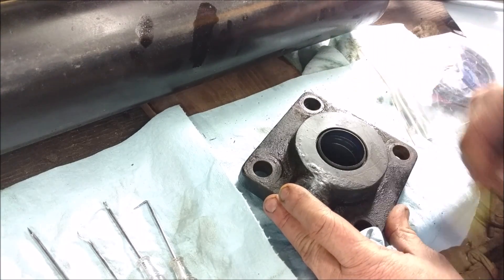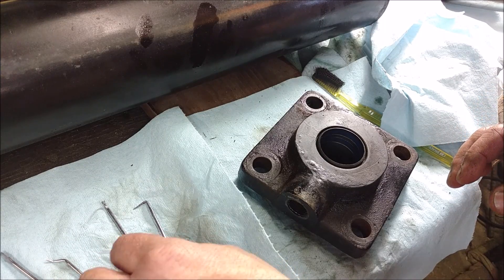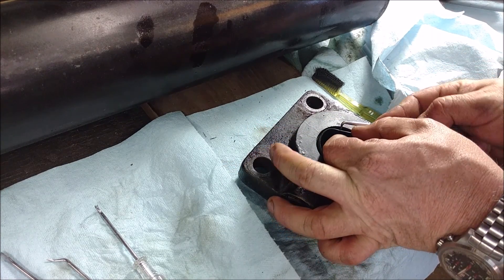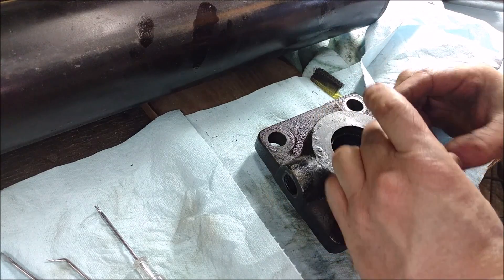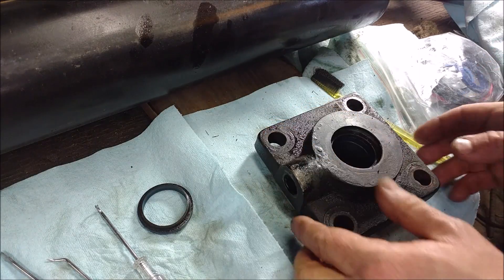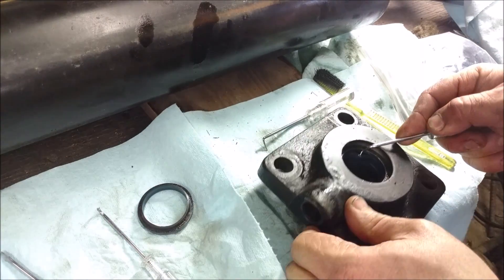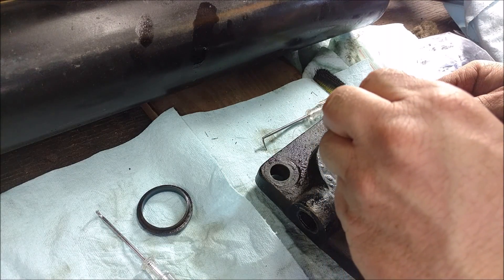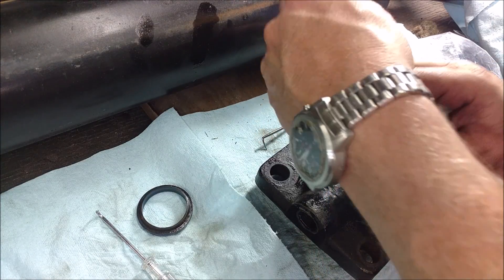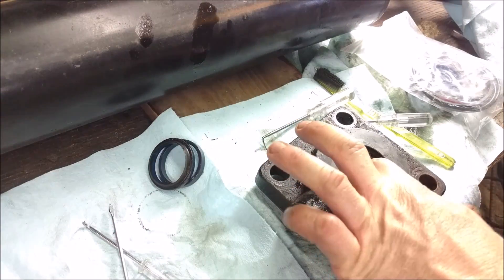Now these aren't typical seals that you would see in the automotive industry — they like to wedge them in from the sides. Let's see if we can dig one out. Instead of having a seal that's just hammered in, they're actually inserted into a groove and set aside. So there's our wiper, and then we'll have a seal behind it back in the block that's blue. This blue seal is more than likely what's leaking — it's the culprit. Easy enough — we've got two new ones to replace them with.